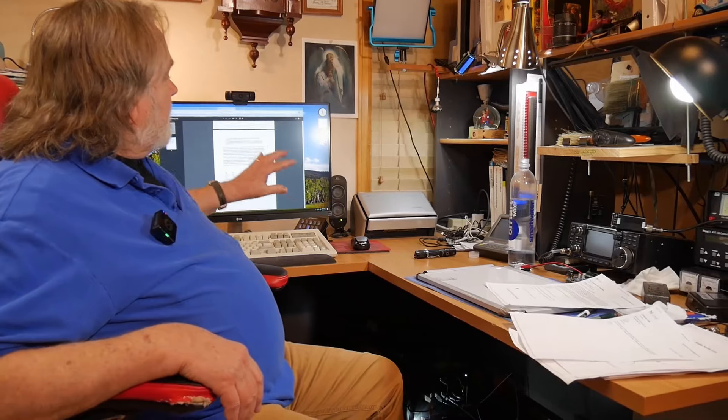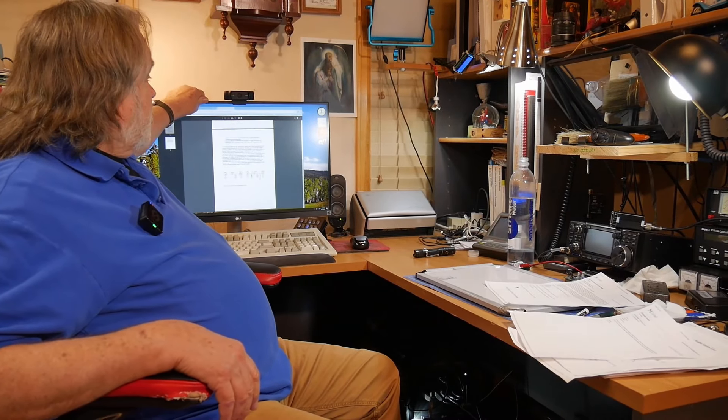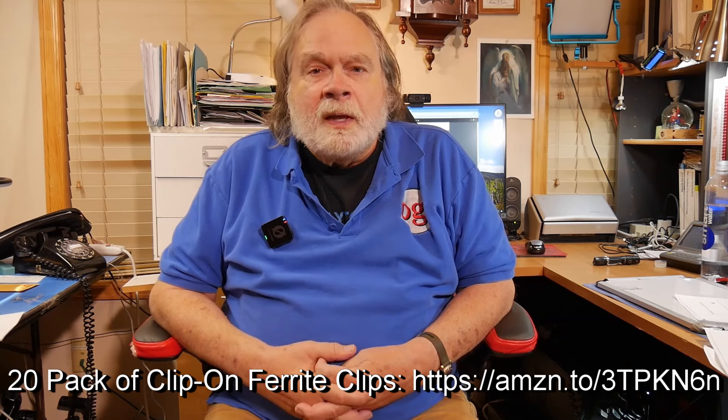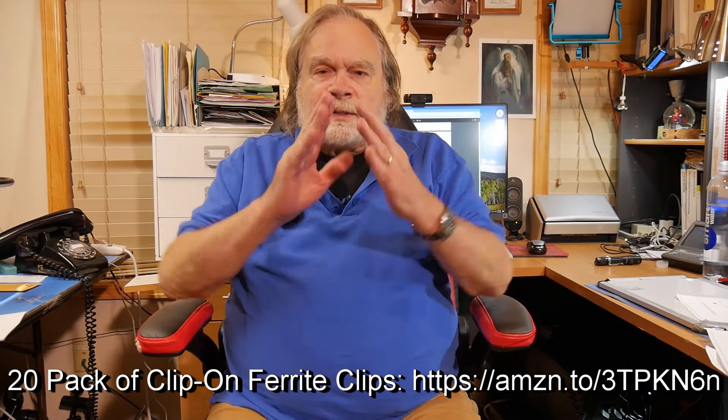So that's our little overview of how to keep these two from talking to each other. This computer right here: steel case, higher-end components, a nice LG 4K monitor. And the radio is all over here. It's going to take trial and error to make it work, but you can do it — don't shy away from it. You can get ferrites from Amazon, including a kit full of different sizes of snap-on ferrites. So there you have it — we've taken a look at ways to make your computer and your radio play nice. Good luck with that, let me know how it comes out. And until we next meet, 73.